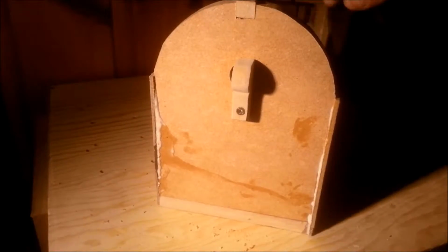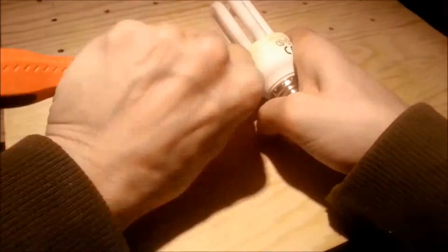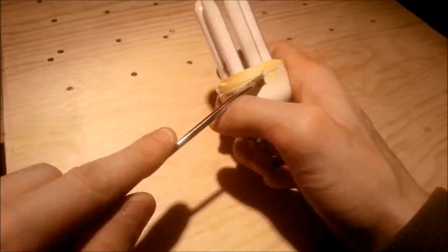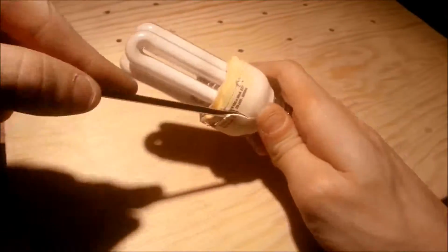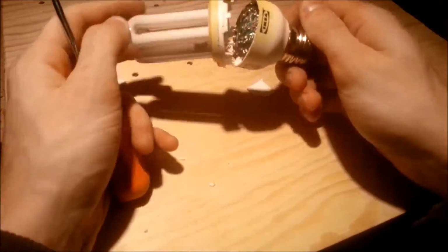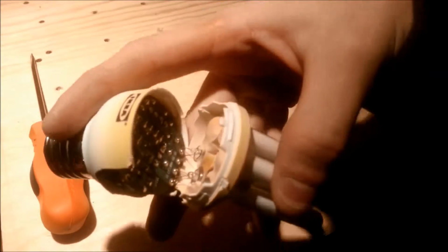Now it's time to look into the electronic aspect of the build, and since I'm of the philosophy that you should not buy what others throw away readily, we're going to use the ballast from a fluorescent bulb I picked up at the e-waste at my local grocery store. There are two pairs of wires coming from the tube that are for the anode and cathode filaments, so remember how they connect, as you have to connect the tubes in the same manner.